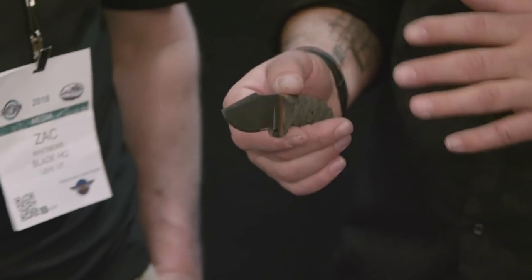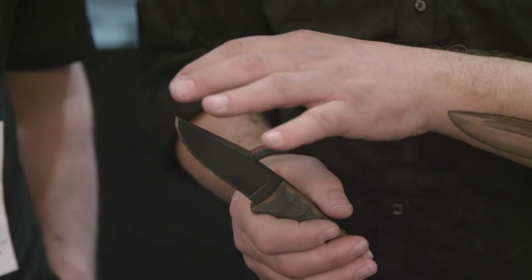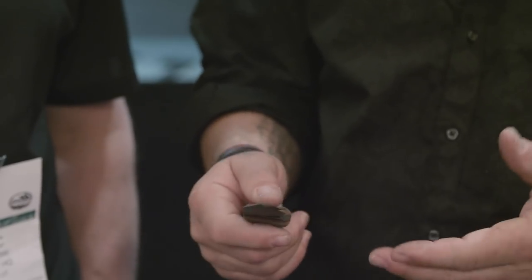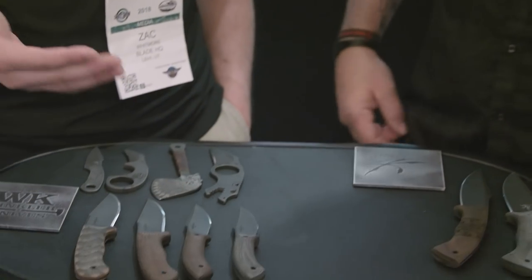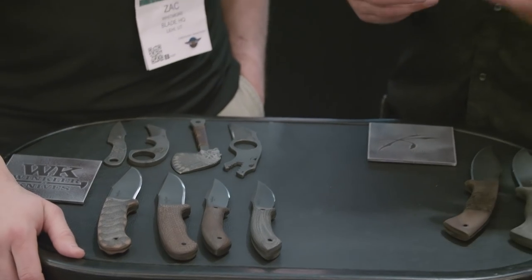I want to point out a feature I like to show people. A lot of times you see a clip, or swedge, on a knife. Number one reason: it looks cool. But the practical reason is it makes the point pointier. Where a knife gets thin, when you increase the surface area out near the thin area, your point is stronger and more durable. Everything on these knives is intentional — I don't want to put fluff on a knife. I want them to be functional and sexy. I'm known for making curves, raised clips, and dropped handles, and I like to incorporate that. But they work — it's all functional.